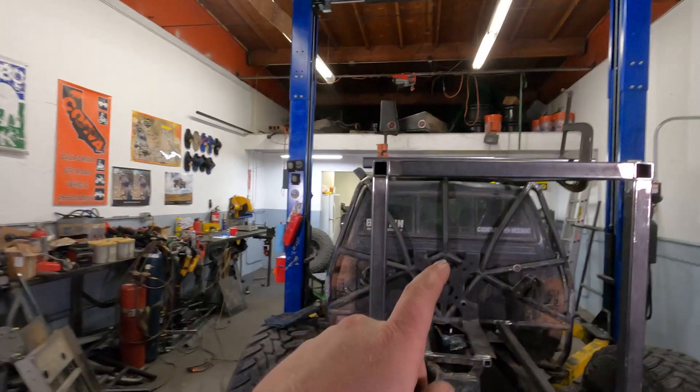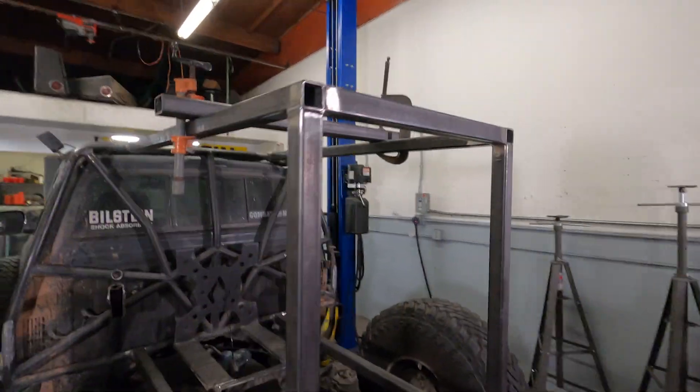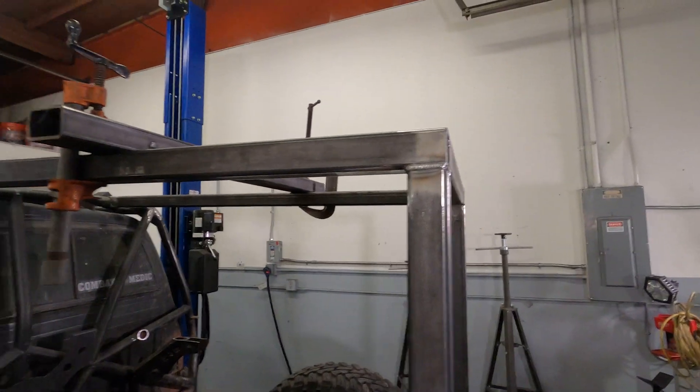I'm going to do a bunch of grinding and welding. You guys have probably noticed we can only spend a couple of hours at a time on this — that's because we have real jobs and other real work to do, so it takes a while. I'm about to break the cardinal rule and just weld in the structure. What you should do is leave everything tacked together until the very last minute because you never know what's going to change — may need to move some stuff, it doesn't end up working like you think. But I have concerns that this entire structure is going to begin to move on its own.